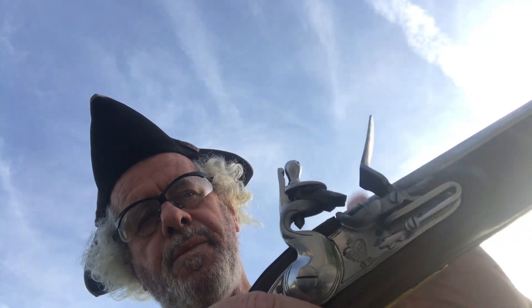This is the Light Dragoon pistol. With the 4F powder, maybe you could get it out. It was cracking off every time, but the frizzen doesn't always pop open all the way. I put a smaller flint in — we had a bigger flint in there, and with the bigger flint you can't hardly get it to go off half the time. What happens is your flint comes up, hits the top of the frizzen, and pops it open. All that does is open it; you might get one little spark that flies off to the side. The idea for flintlocks is that the flint hits the frizzen and as it opens, it scrapes down the steel frizzen creating sparks and putting them into the pan.